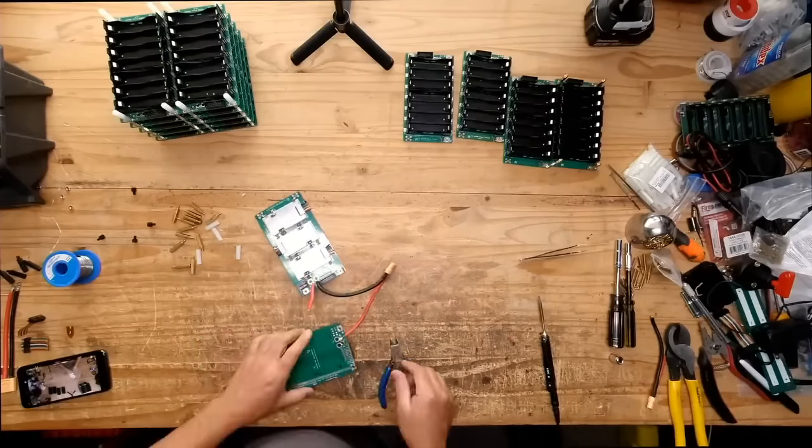But anyways. What's the most powerful battery you would use in this board? Okay, so the limiting factor in these boards are those little springs, the spring contacts, and those can handle about 4 or 5 amps. By design, I think, right? They did that because they're gonna put batteries, and they know that the largest battery in 18650 form factor is about 3,400 milliamp hours. So they're usually 1 or 2 C's.